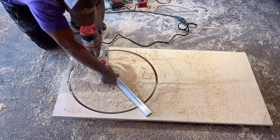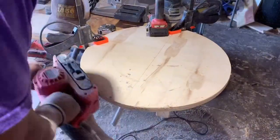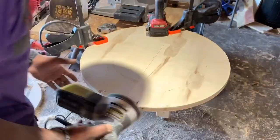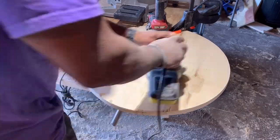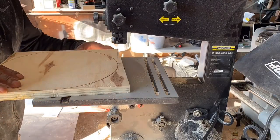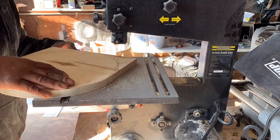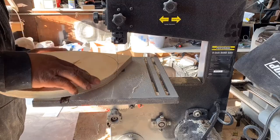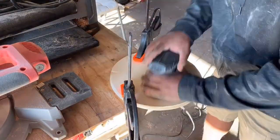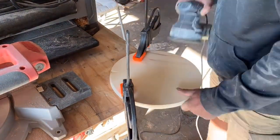Now, time for the base. Using a half-inch spiral bit with my router. Back to sanding — the router bit chipped the edges on this one, so this one took a little time to get it back round. I wanted to add a small shelf that would sit right under the top, in between the top and the bottom, but something large enough to sit remotes on or small books. I just picked up these quick clamps and they are awesome — I recommend you get some. I'll leave a link in the description below.